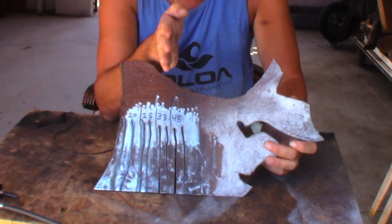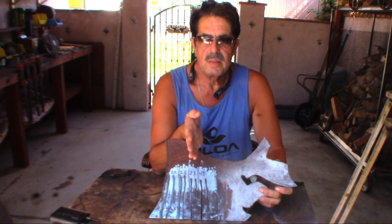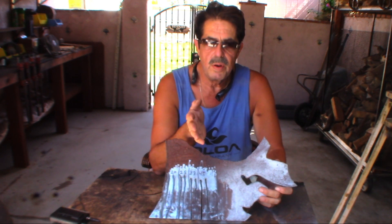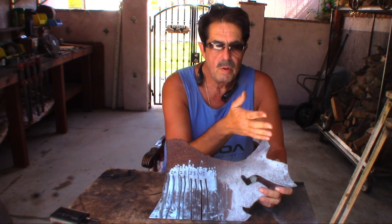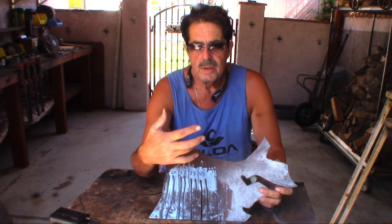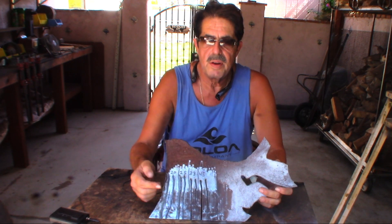The amperage is important — it's probably what gives you that burn-through — but what's a little more important is having that PSI set correctly. You need to be at 95, or ideally 110–115 PSI. You could go up a little more, but for 18 gauge sheet metal this thing cut beautifully, and you can see these lines as proof. I'll zoom in here in a second.